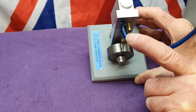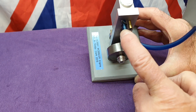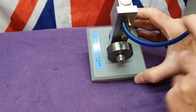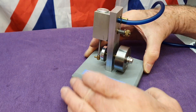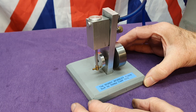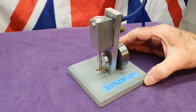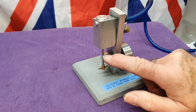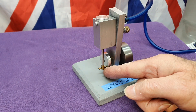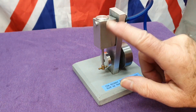There are two little brass tubes here that give you the air going in and the exhaust coming out. By moving the little pipe across to this one it just reverses the operation of the engine — very simple indeed. The difficult thing initially for me was getting a good fit on the piston. The piston is made out of a tiny bit of steel so there won't be any reaction between the piston and the aluminium cylinder.